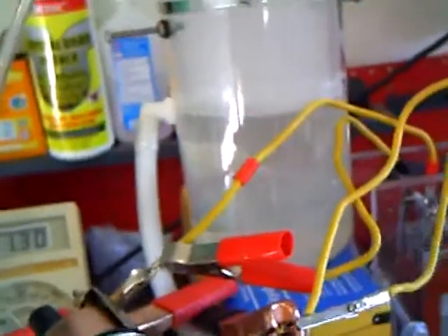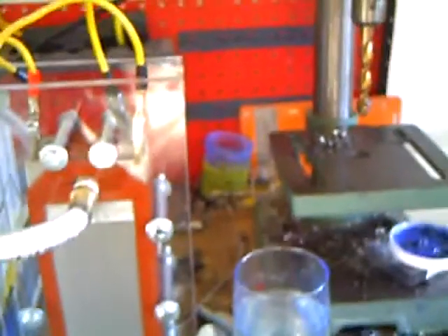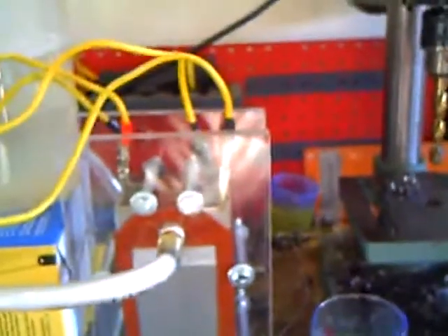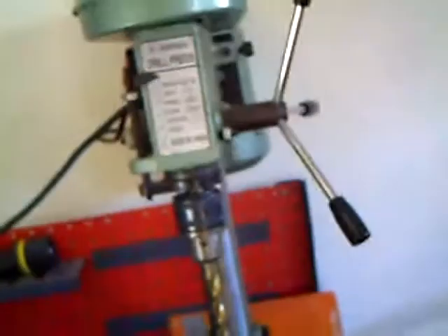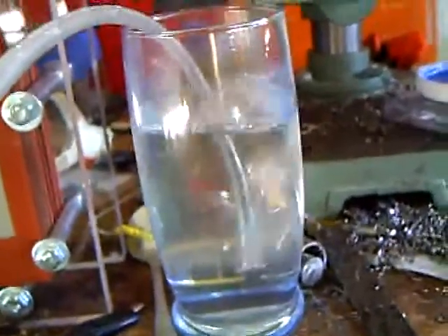25 amps. With my MMWs staying about where I want it to, I wanted to say a little bit about my cell and how I made the plates the way I did — very specifically because Zero Fossil Fuel says that a taller cell is more efficient. It says it's like a chimney. I made my plates three and a quarter by eight and a half, minus my gaskets.